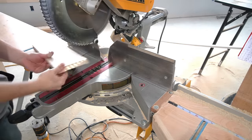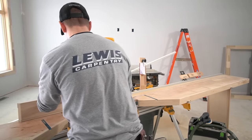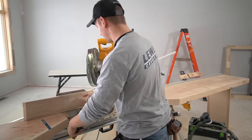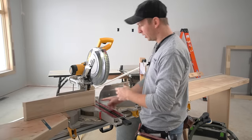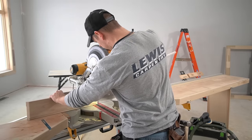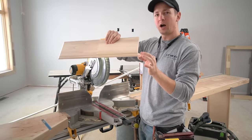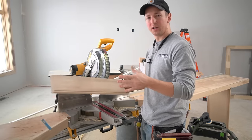So here's the advantage to cutting your baseboard upside down. If you cut the baseboard with the profile on the bottom and make your 45-degree cut for your cope — thinking of a non-slider miter saw here — now I have access to this whole straight line and I can make that cut with my miter saw. That piece will break away and I've only got the very top here to cope by hand. And that is why you want to cut your base vertically and upside down.